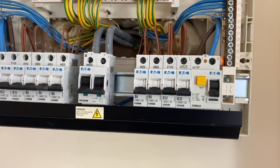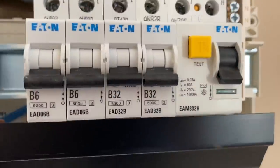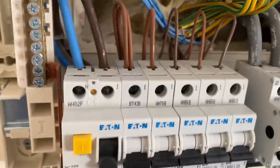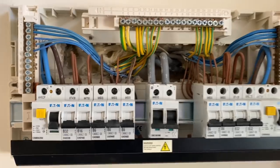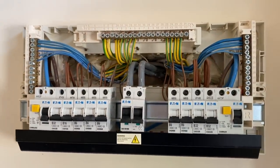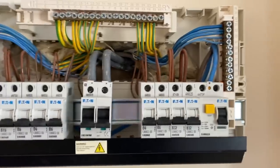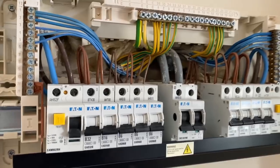I'm back here and I've just swapped out the circuit breakers - got rid of the 40 amp ones and fitted matching 32 amp breakers for the ring circuits. That's much better. Five-minute job, easily done. That solves the issue which could have been a C2, so we've sorted it out and don't need to mention it on the report.